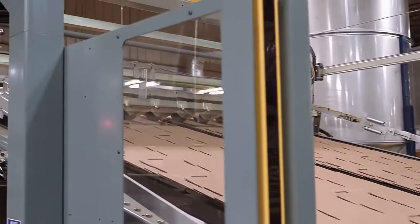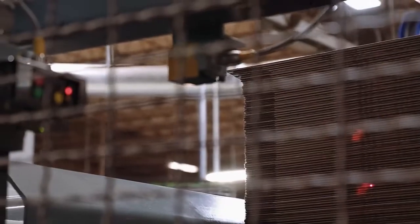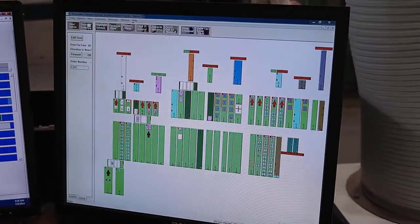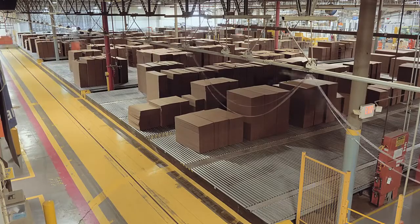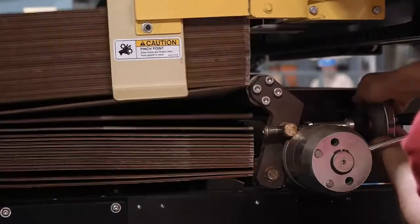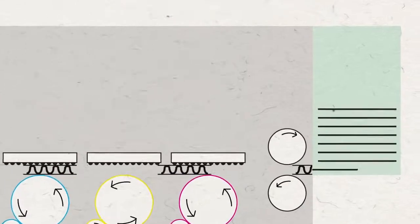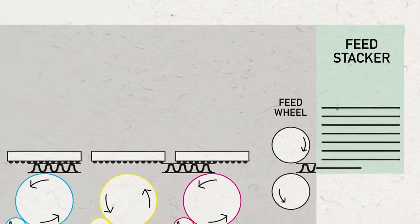A rotary die cutter also has the ability to produce multiple boxes from each sheet, whereas a flexo machine yields one box for every sheet. Through a series of lasers and optical sensors called photo eyes, and communication between an inventory management system and real-time production scheduling, material is transferred to each machine center onto an in-feed conveyor. Automatic transfer carts keep each machine fed with corrugated sheet stock. Each stack is broken down into smaller sections called blocks and shingled individually to a feed table. Feed rolls, made of a soft durometer material, insert the sheet in the machine and prevent the board from being crushed, maintaining board caliper or thickness essential to overall board strength.